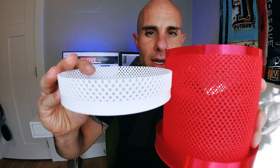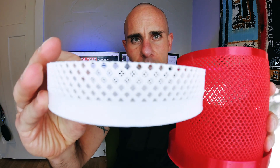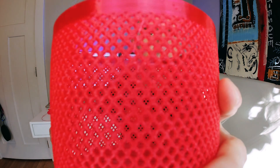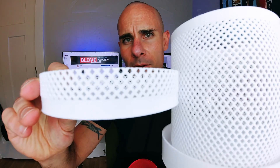So this is one of the 0.4 millimeter prototypes that I've printed out — this one has 0.4 millimeter layer heights. You can see that the mesh is probably where you see it the most, but honestly comparing this to 0.2 millimeter mesh there's not that much of a visual quality difference. If you look closely, this was 0.2 millimeter layer heights and this is 0.4. Honestly, if you didn't tell me which was which, I don't think I would be able to tell either.